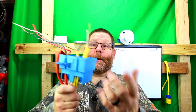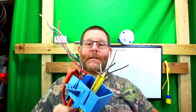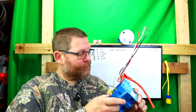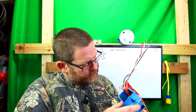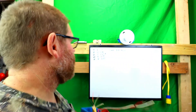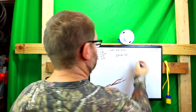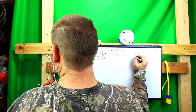We're going to talk about this box right here. It's a makeshift box but it works. We have two 12-gauge Romex cables and one 10-3 in here. We're going to assume this is just a junction box. First thing we need to do is find the cubic inch rating — this particular box is 34.6 cubic inches. We have a 10-3 and two 12-2s.